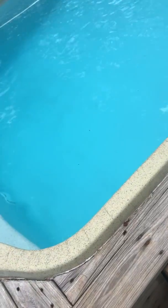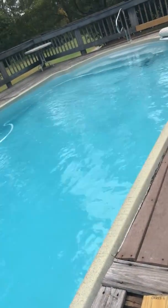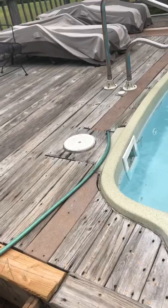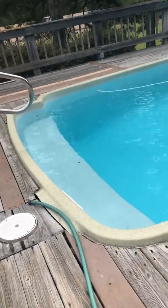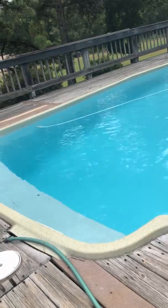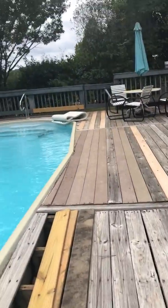Anywhere close to the pool we're going to replace those hangers — pull them out. They split a lot of these joists because they nailed everything. Some of them we're going to have to sister, which means just screwing another 2x8 or 2x10 next to it for support. They don't look rotted except right around the pool. All the joist hangers within two or three feet of the pool we're going to spray with Rust-Oleum first, then install them, and that'll minimize the corrosive effect of the saltwater.